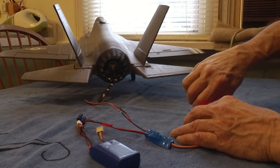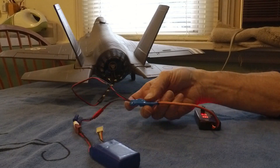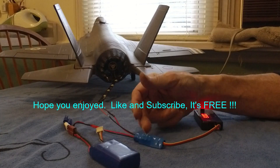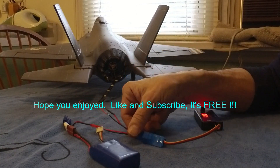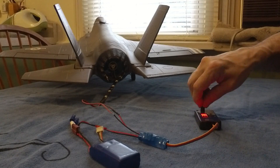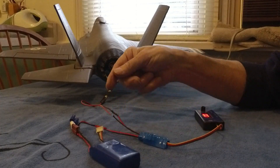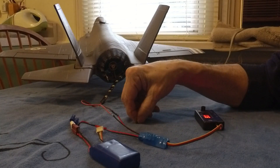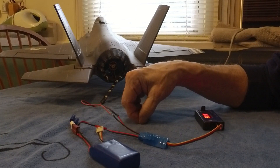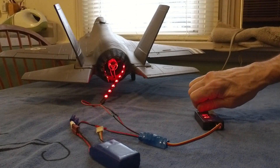You guys get the idea — it would be throttle operated, simple, easy to make. This thing only costs about two and a half to three bucks from China, or about seven or eight bucks faster through Amazon. If you get one where the switch midpoint goes up and down from center, that's when you want to put a diode between one of the power wires to limit the direction of flow, so that below the center throttle point the lights stay off and above it they come on. There's an article on Hobby Squawk — very interesting. I'll see if I can find the address and pin it in the description. Take care guys, have a happy weekend. Happy flying, bye for now.